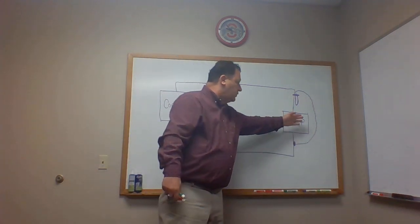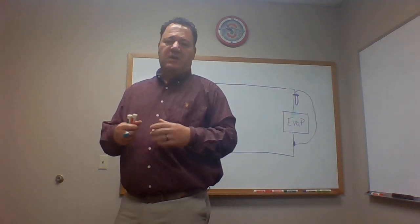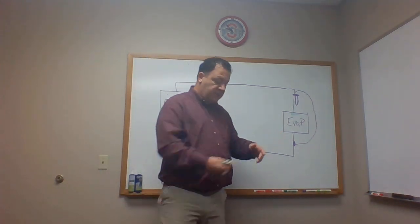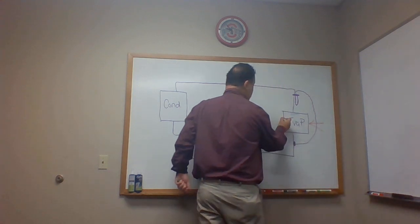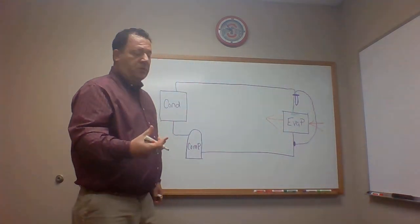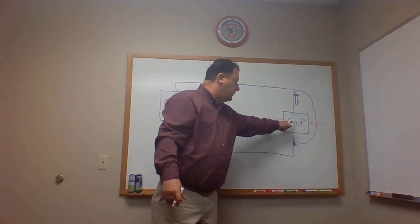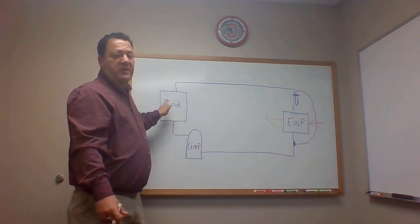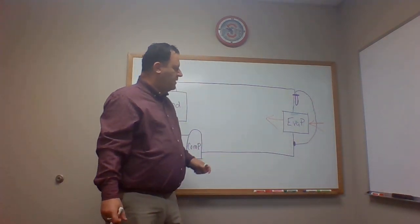So as we're going through there, we're absorbing the heat. And again, we're not making anything cold. We're literally removing heat from the air coming through our evaporator. It's colder on the other side. We're removing that heat. We're heat movers, right? We're moving it from one place we don't want it and putting it out somewhere where we don't care. All right? We're picking up that heat in our suction line and moving it on down the line.